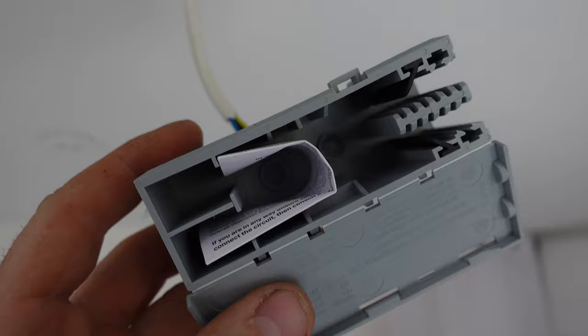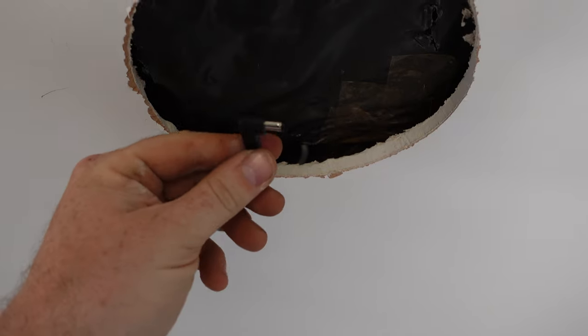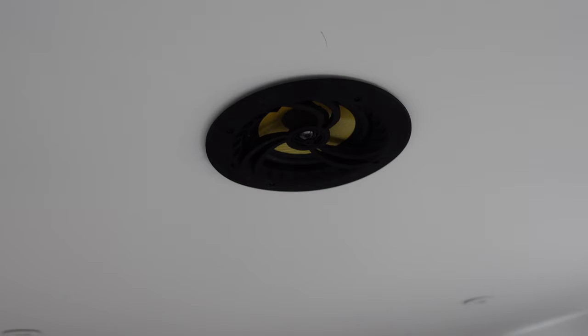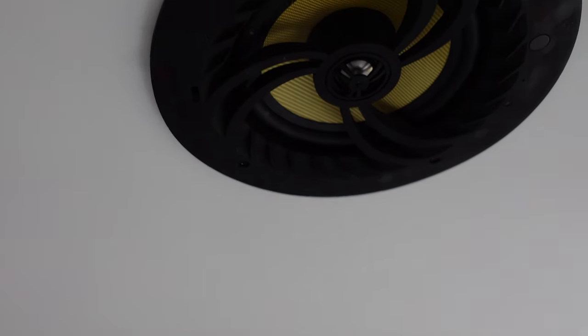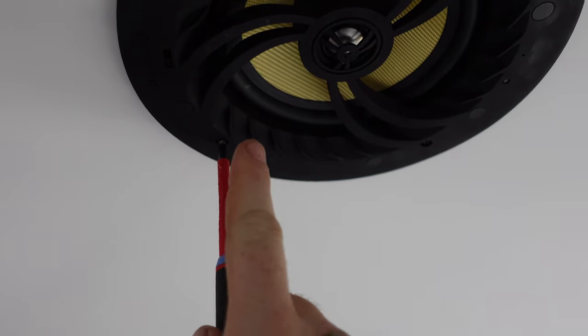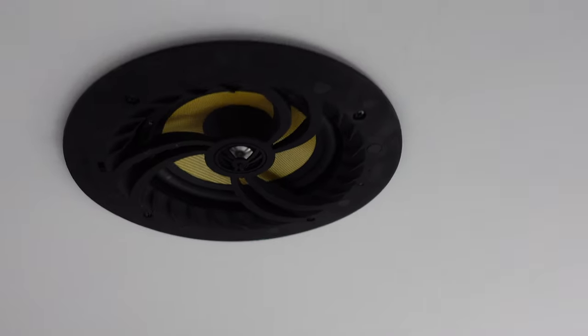Cable is now jointed. I've just got to clamp the Wago box around it and push it up into the ceiling. With cables all pushed up, I've left the adapter that plugs onto the top of the speaker and pushed it up into the ceiling — she's up! I've got my screwdriver into all four screws, slackening them off slightly, pushing the wing toggles out, then tightening them down onto the plasterboard so it's holding in place nicely.